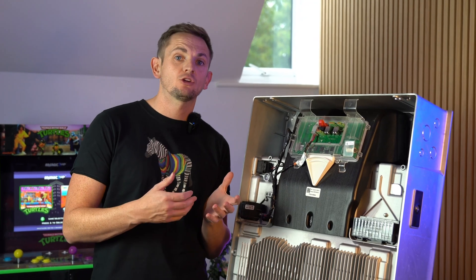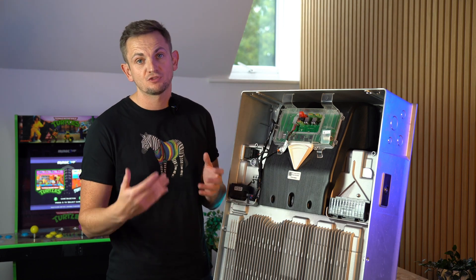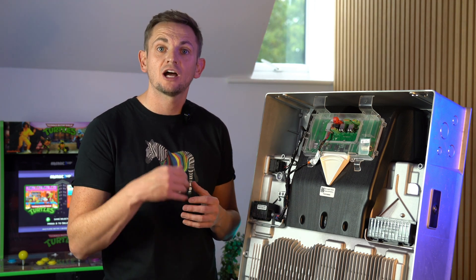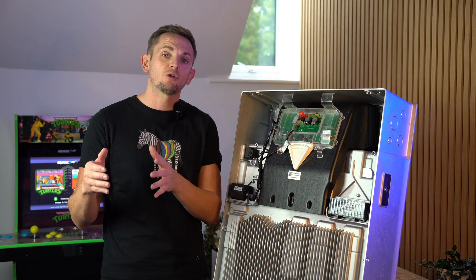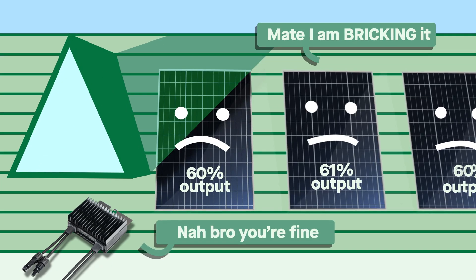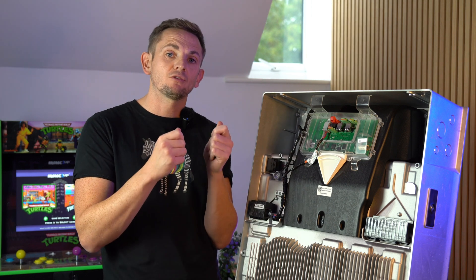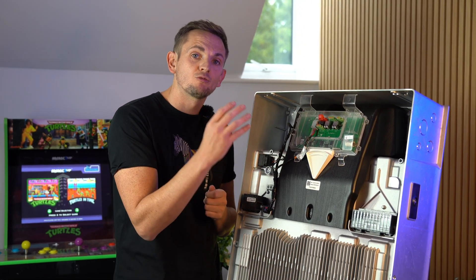When would you AC couple and DC couple together? On the majority of installations, because most people want to charge their Powerwall overnight with cheap electricity even if they have a DC-coupled solar solution. Another relevant case is a recent Tesla technical bulletin around optimizers. If you have shading, you might use an optimizer to prevent one panel dragging the rest down. However, Tesla's inverters have arc fault detection, constantly monitoring for problems with high-voltage DC panels.